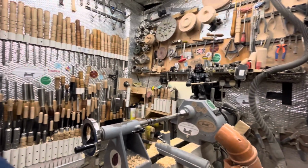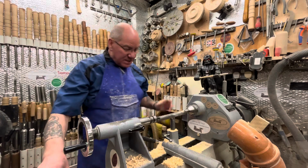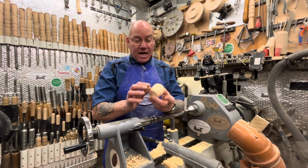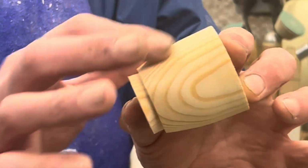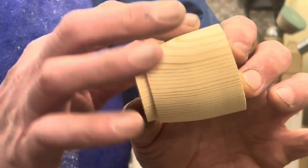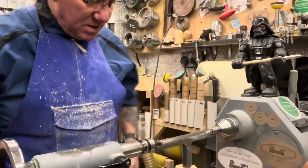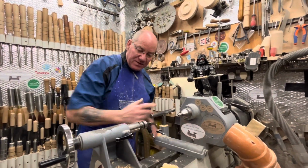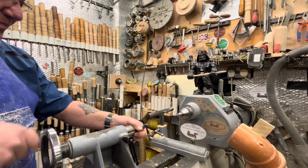And this is the more the bit. So we've got two different things. Let me take this off so I'm not shouting. We've got two different things here. So we're using our square chisel like a skew, okay? And as I said, because I haven't sanded it, I haven't done nothing, guys, this is the finish, okay? That's on that pine, all right? We've got that finish. We'll rub it with a little bit of sandpaper, we'll tickle it, but when we've done the other bit, I'm going to take this off and pop that in a chuck.